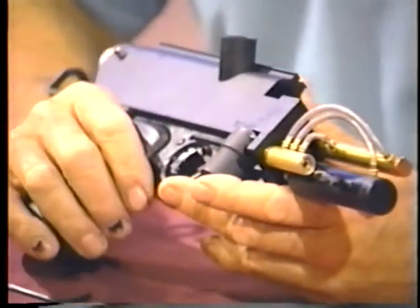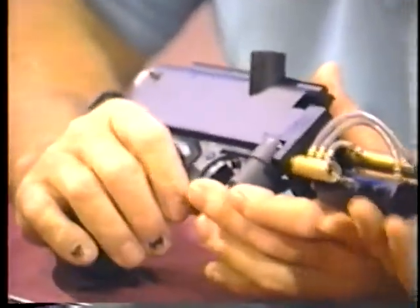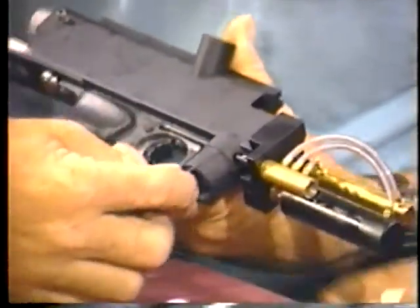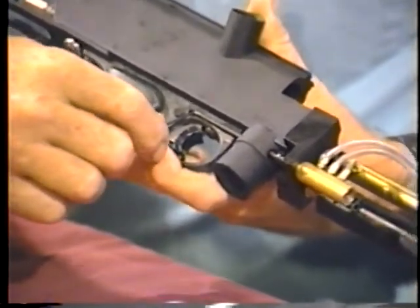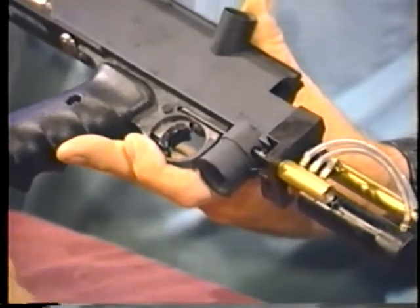This should be pretty well adjusted. Sometimes you have to fine-tune it, but this will get you home. Okay, so to repeat, Bud, you push the 3-way collar all the way in. All the way. It puts the 3-way collar all the way forward. Push the actuating rod all the way forward in the trigger assembly, and then tighten up the 3-way actuating collar. That's your start point to set the timer.